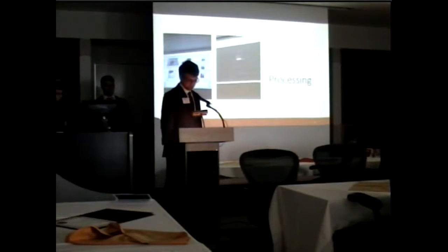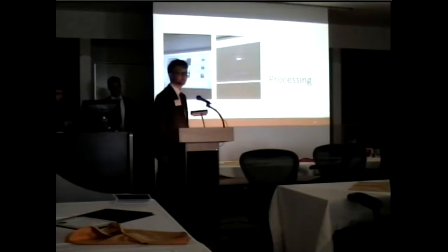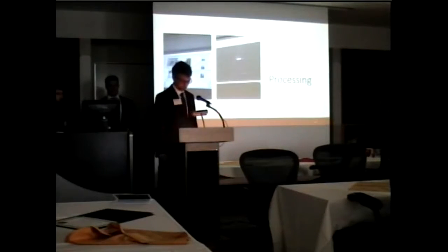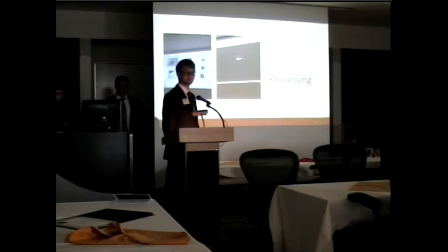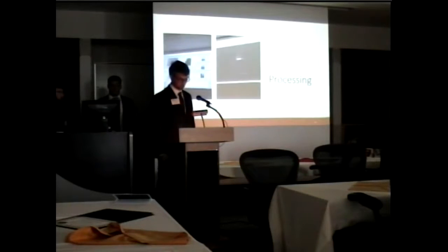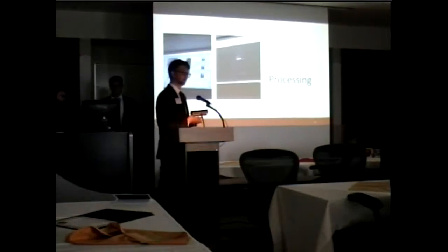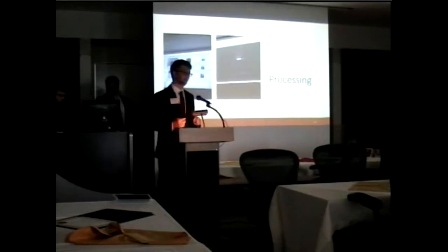So, PosPath software takes the initial trajectory from the GPS and IMU and the base station. We used the Ferris State base station on top of the building, and it processes the GPS against what that base station is reading, and then smooths it out and creates a best fit trajectory. Then that best fit path is brought into RiProcess. In RiProcess, the trajectory can be imported and aligned with control points to create a more best fit.